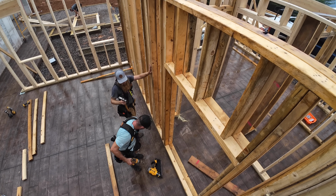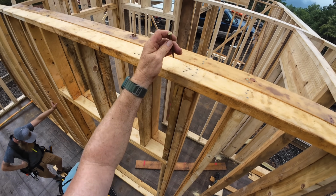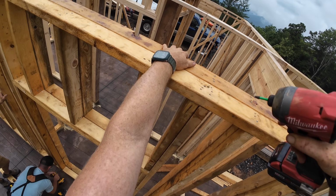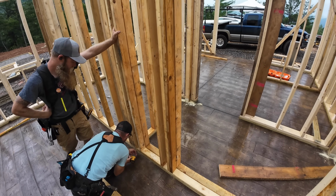We've got our double thick wall built here, and I'm just gonna toe screw this together anywhere there's 2 members. I can just do a toe screw without it popping somewhere, including anywhere up here really. So just gonna run like that. Do some in the header here. See if these are flush here. Not quite.